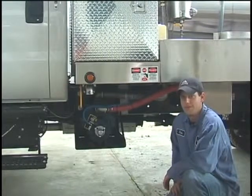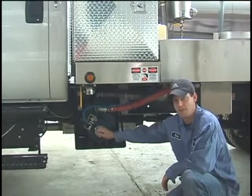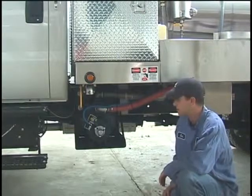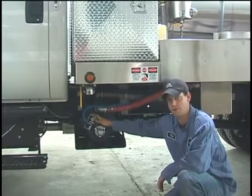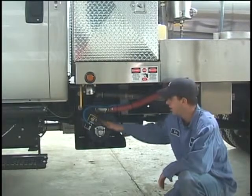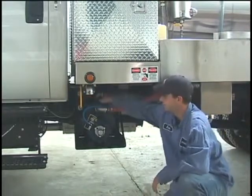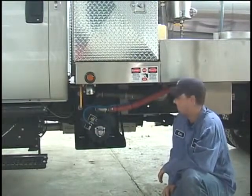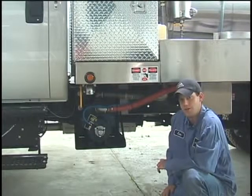This is a Ford F750 equipped with a mechanical drive shaft driven vacuum pump — it has a Massport XLW4 on it. This pump has a gear-driven oil pump inside, so it doesn't use vacuum to move oil; as long as there's oil in it and the lines aren't clogged, it will pump. It's a simple flip lever: pressure on the left, vacuum on the right. It will build vacuum until 18 inches and then the vacuum relief will shut it off. If you put it on pressure, it will run until it reaches five pounds, which allows you to empty your tank or unclog your line.